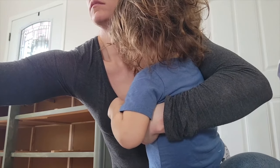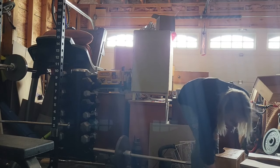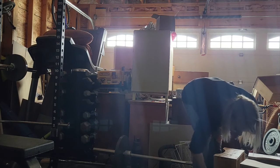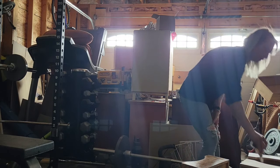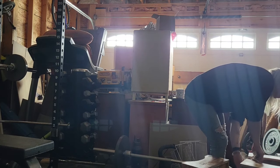And then we went over it with a polyacrylic just for extra durability. Then I took the raw wood drawers into the garage and I wood conditioned it, followed by using Early American stain on these. And I just love the wood elements with the green tones of the painted piece.